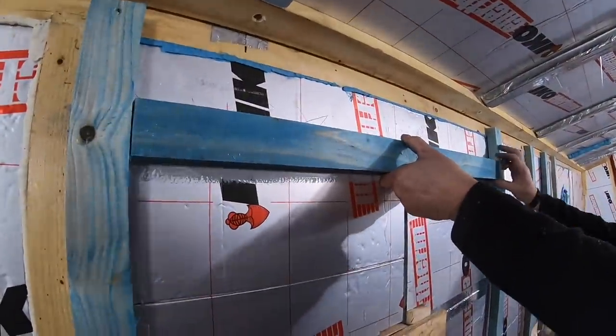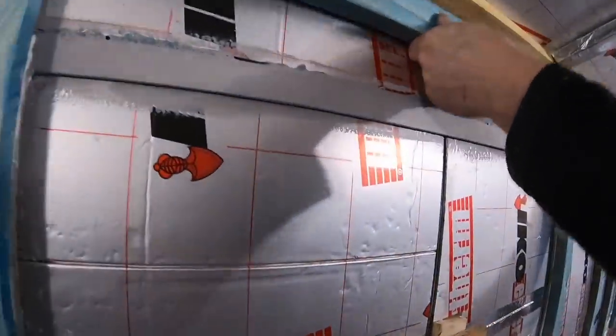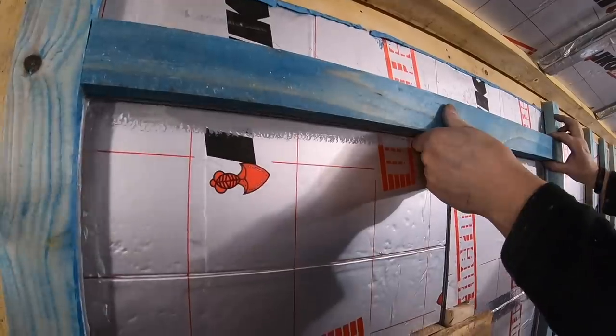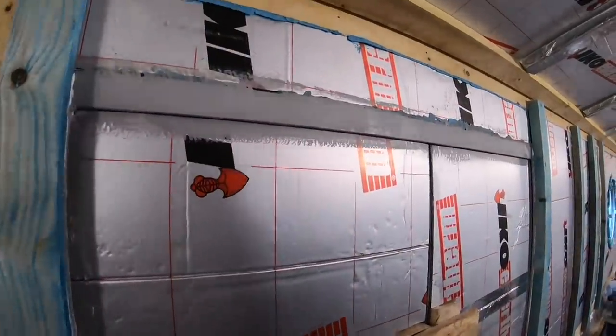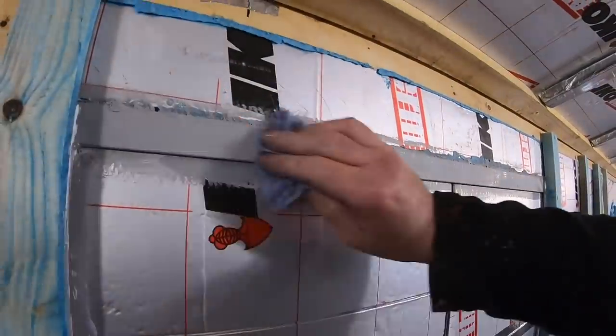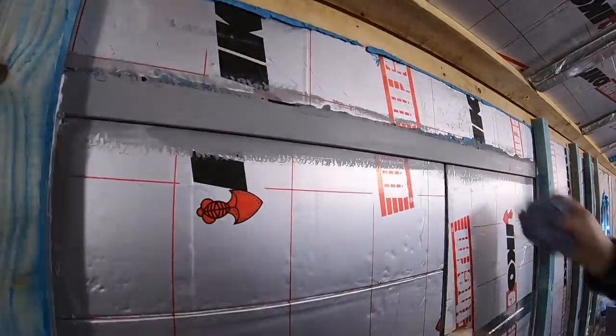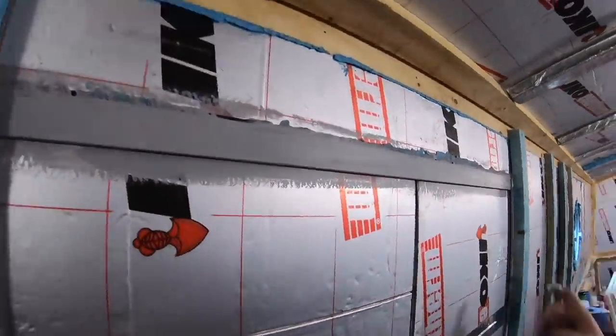This is us trimming out the side hatch, and we put three lines of adhesive on there. The reason being behind it is we wanted to try and stop any moisture or anything getting behind or between the woodwork and the steel from the top and the bottom. So that's the reason we went with these three lines we're putting on now.